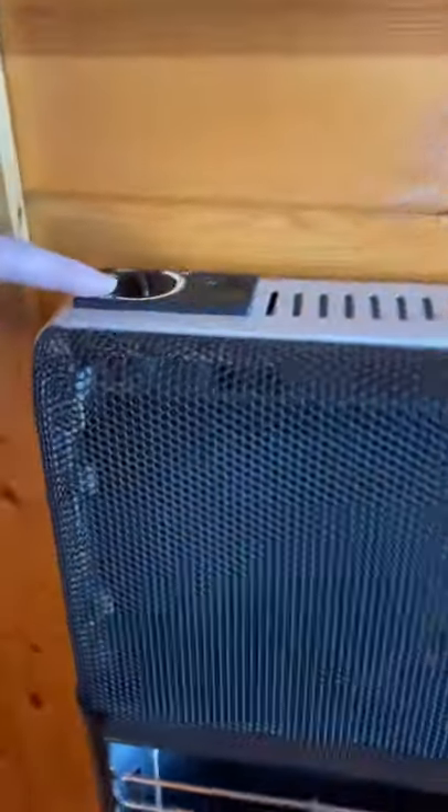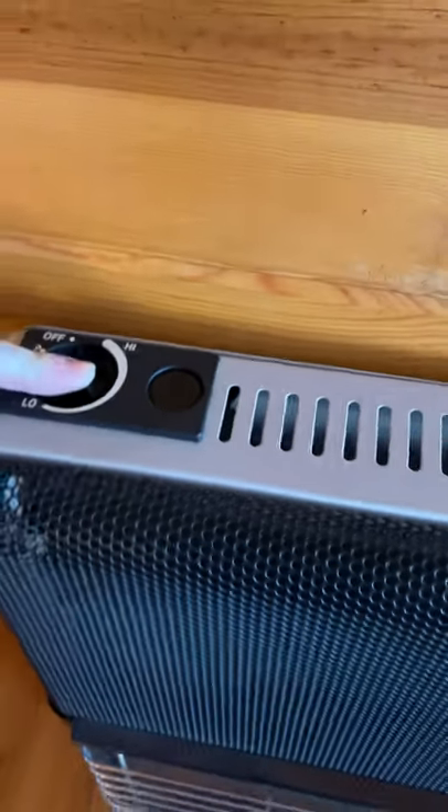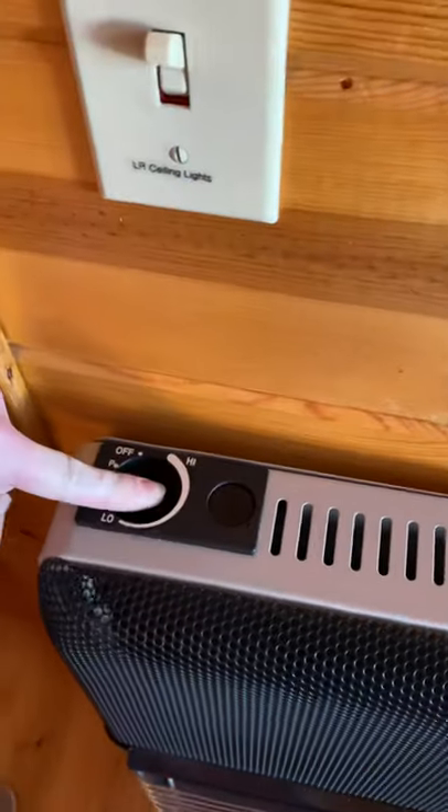At the top, the control switch turns to P for pilot light. Hold down the button. Click for ignition. Make sure the pilot light is lit. Hold the button down for 10 to 15 seconds to keep the igniter on.